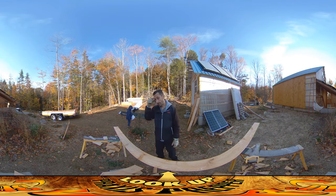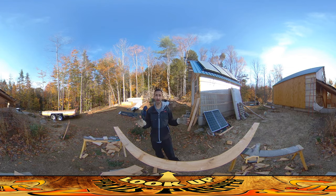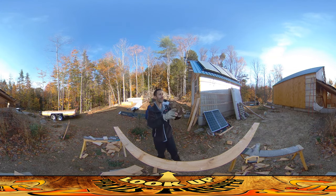As you notice, there are these big triangular-shaped holes in the backs of the greenhouses here — those still don't even have structure in them. I've got to do the posts under there, put on the interior wall boards, then put on the foam, put on the strapping, and then I can continue the exterior wall boards across that whole back section there.